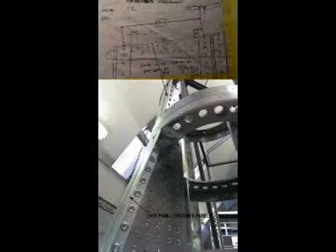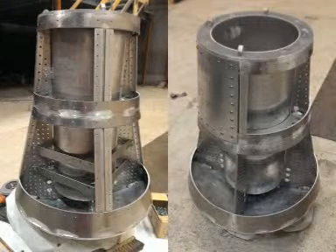The images above show the TDS-80 in its current state. The main structure is done. A test side panel has been produced and the internal bars for holding the main avionics box are likewise done. The next step is a detailed examination of all subsystems and understanding how to attach these to the capsule. Now that the main structure is done, we will have time to look into ballute design and perform testing on top-level deployment using air-backed devices.